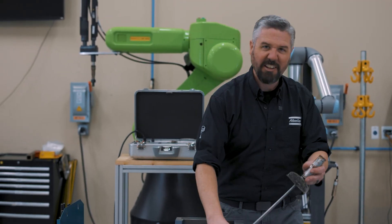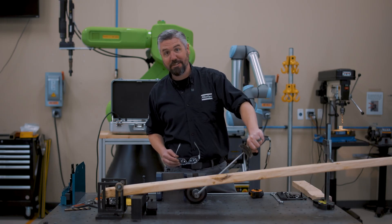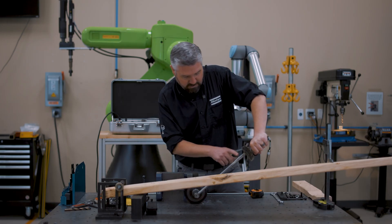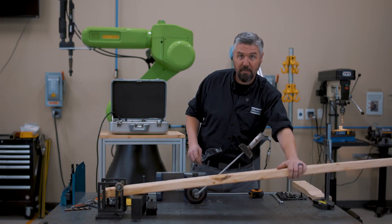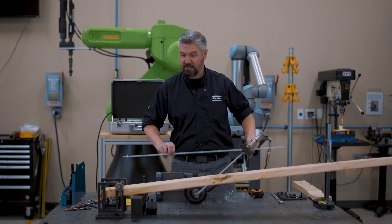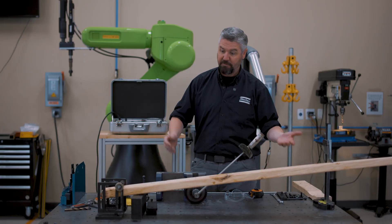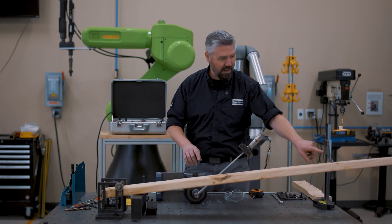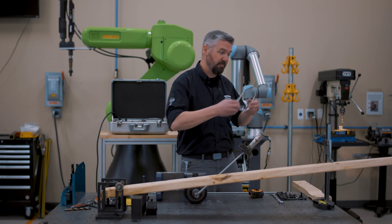Before we begin, let's do some quick tests to see how much bending we get with a 2x4. We've got my garage sale deflecting beam torque wrench set up here. You can see the dial — when I push down on the handle, the indicating rod stays straight and the beam bends. This will be our deflecting beam and this will be our dial rod — it's about 40 inches long. I want to see how much deflection we get with a 2x4 to size this thing correctly. I've got my height gauge set up with about 40 inches of distance. Let's see what happens when we put some force on it.